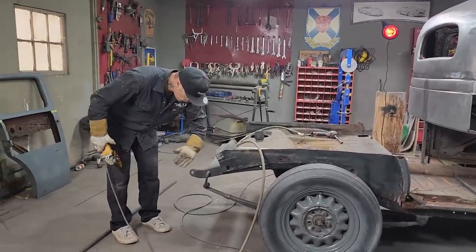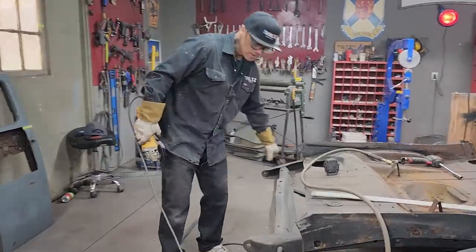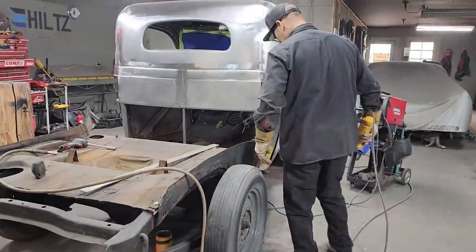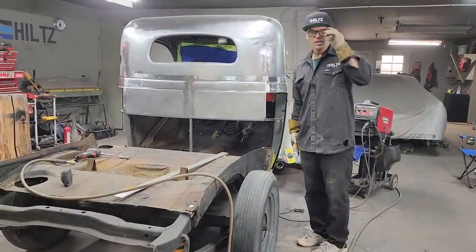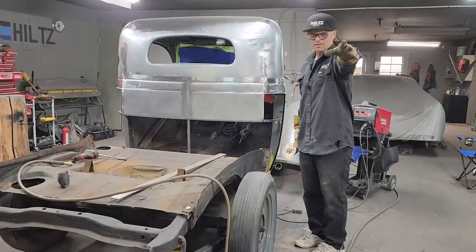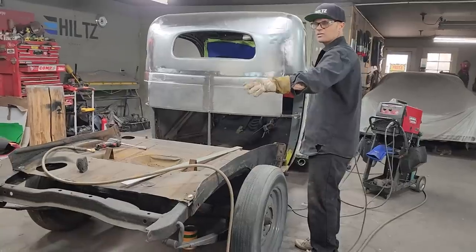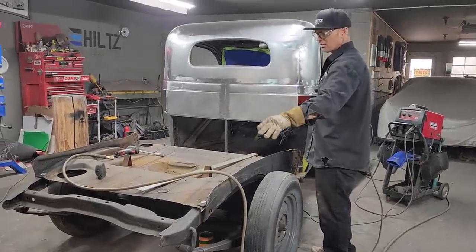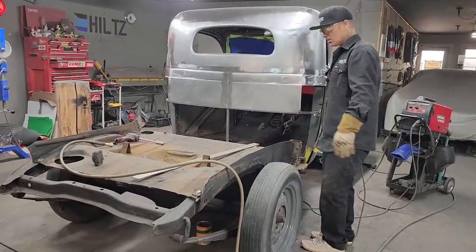I know what the chassis sort of looks like underneath, but I do not know what it looks like on top. When we were just talking here, me and Jolene, I'm looking at the chassis, and I can see it's a bit pitted. I said, Jolene, how would I ever get that smooth? She said, well, you have to sandblast and fill it. Exactly right. In order to make a chassis look really nice, you'd have to sandblast it and fill it. You're not going to sandblast a pitted chassis and paint it and make it look nice. It's not going to happen.